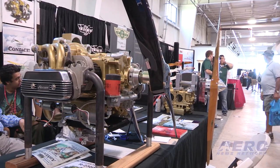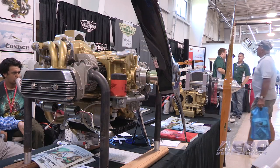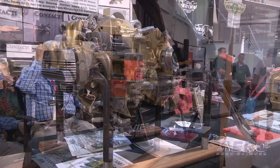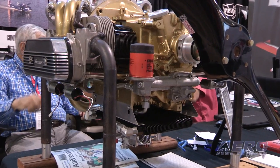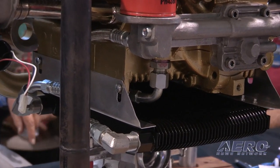What is it about putting a Volkswagen engine in an airplane that is appealing to the sport pilot or the aviation builder? The weight and the cost — both are lower. This engine is conservatively rated at 85 horsepower and weighs 170 pounds. Things like exhaust piping and engine mount bring that up to around 180 pounds. This latest model is a 2.33 liter piston displacement and is among almost 4,000 engines that RevMaster has made for airplanes.